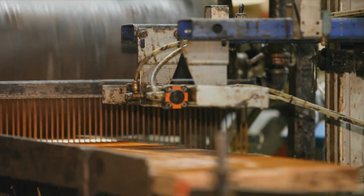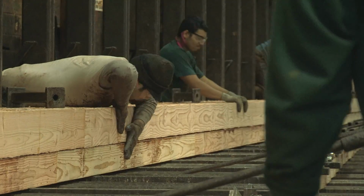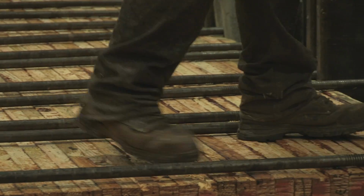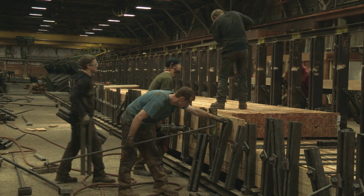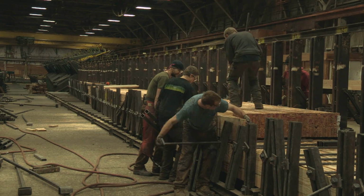Each board passes under the glue applicator and then is stacked vertically in the gluing rack. As the clamps are positioned in the rack, a worker pounds down the edges of the boards to minimize the gap in the unglued edge joint. This unglued edge joint that is allowed by ANSI standards varies according to the size of the pole and can be as wide as 13/16 of an inch at the time of manufacture.